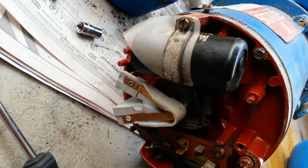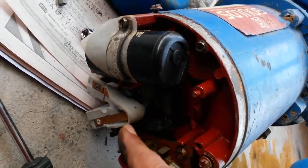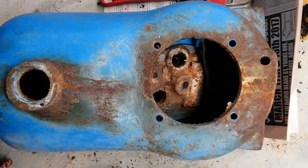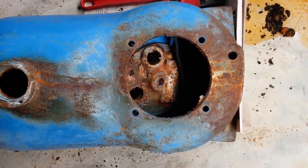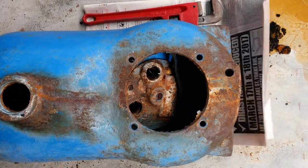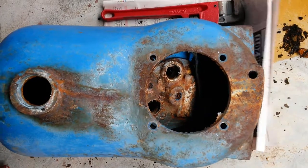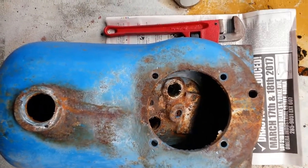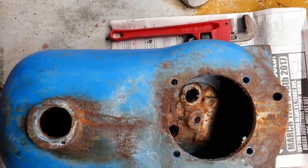This is the back of the motor, as we expected, a start capacitor, and it looks like some kind of governor mechanism. A few more knocks haven't taken all the dirt from the back, and that has separated. I'm seeing a rubber seal. Hopefully that's good. I'll turn this around and show just how much dirt came out with just the initial fast scraping with the screwdriver, not scraping up on top here yet.